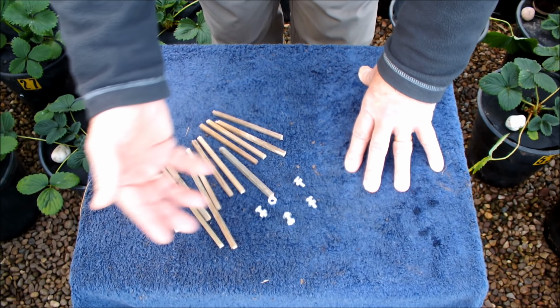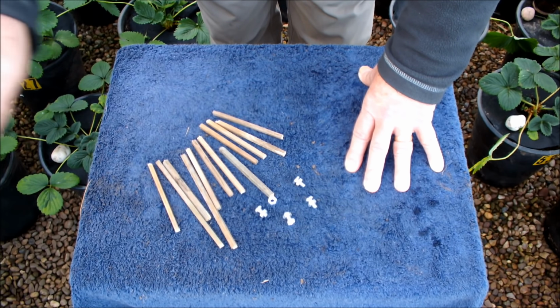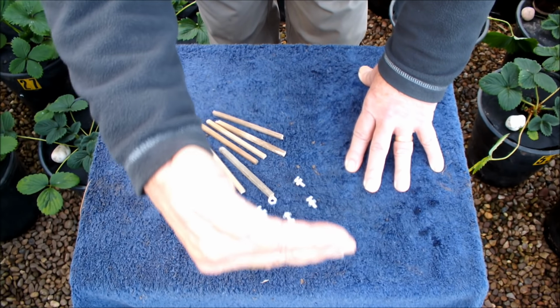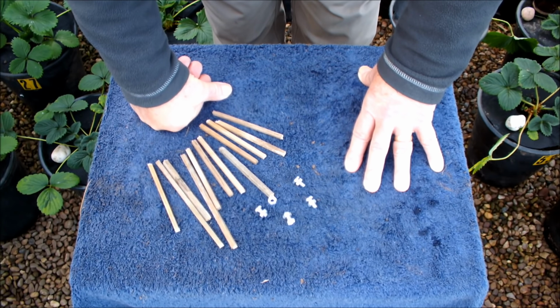otherwise they'll blow away. And what you find when you get in here, in storm conditions, because they're only fixed in the corners, the side walls belly. They're sucked out and they're blown in, and they're sucked out and they're blown in, because they're not fixed in the middle to anything. The base is only fixed at the corners.